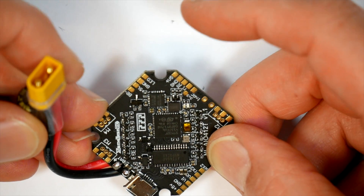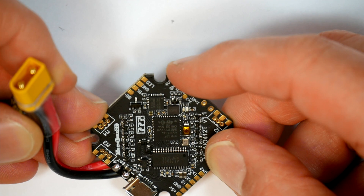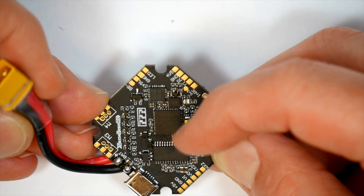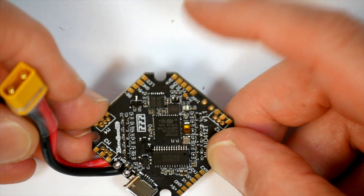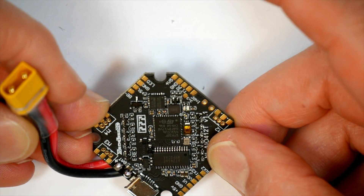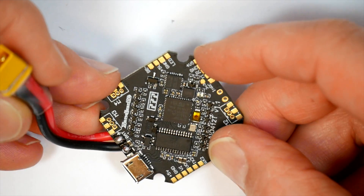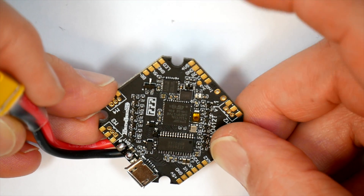You get a 5V 2.5A BEC, an inverted and non-inverted SBUS port, so it's easy to choose between something like an FrSky XM or a TBS Crossfire receiver without losing a UART. You get the Betaflight AT7456E-based OSD, a buzzer and programmable LED connections. There are two UARTs — one for the receiver (FrSky, TBS Crossfire, R9M or Spektrum) and the other for smart audio. The 4-in-1 ESC delivers 12 amps continuous and 15 amps peak using DSHOT 600. It's fairly standard for a small quad all-in-one, but what makes it different is the way the board has been laid out.